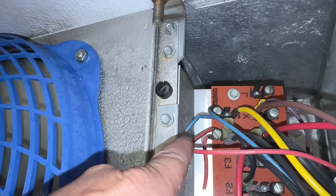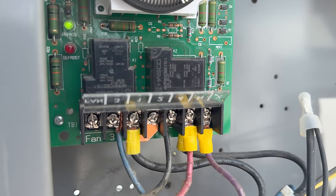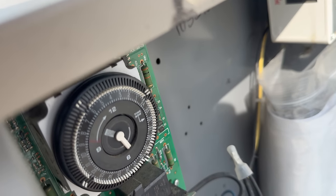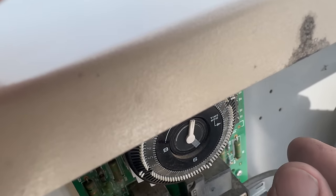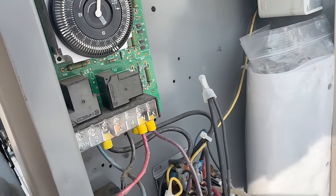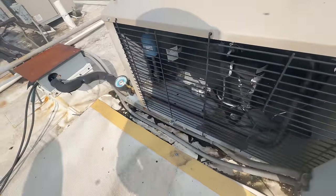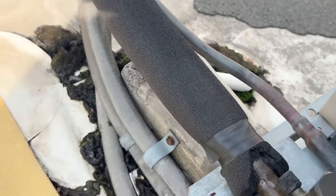All the wires are hooked back up — let's get it back together. We've got the X terminal hooked back up and all the other terminals corrected that were half-ass laid in there. We're turning this back to normal and setting the clock — it's five o'clock so we want 17:00. Setting it for 45 minutes so the defrost termination can do its job. Sometimes a half hour is plenty but right now I'm not parting with it. The sight glass looks clear. Suction pressure is running about negative five on R-404A — that's about what we expect.